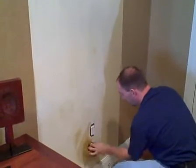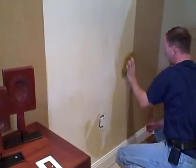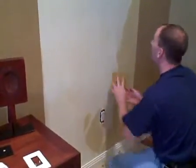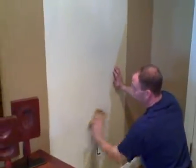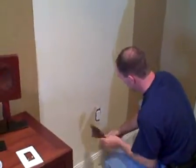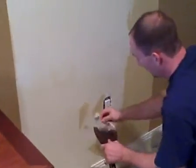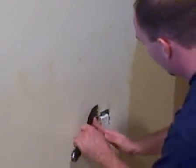Just make sure you keep it wet as you go — it doesn't have to be soaking wet. It gives the glue time to reactivate and peel right off. Keep it saturated, it breaks down the glue a little bit. And if it starts giving you a little trouble coming off, just roll back over it with a wet sponge and it should soften the glue up enough that you can remove it.